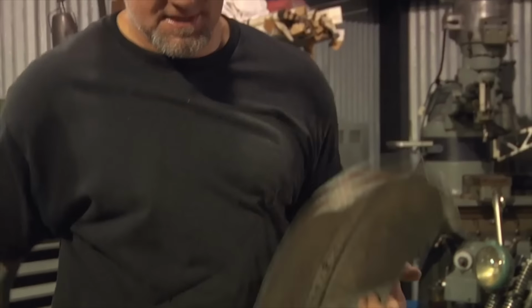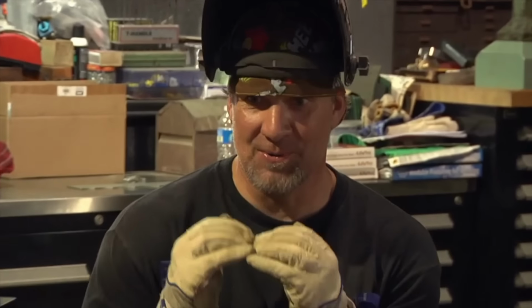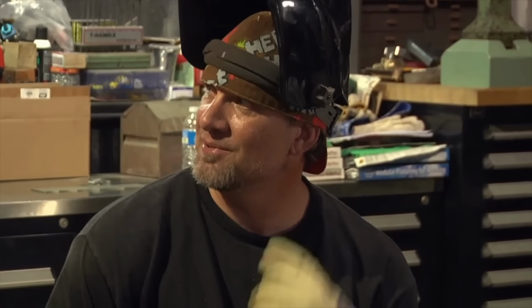You always sand those tacks down. Never weld over the tacks unless it's a super flat one, because then it'll camel hump, because metal will add more metal where there already is some. And one good thing about that bead is it holds the piece in place. It won't warp it up. It'll stretch it and move a little bit, but it pretty much locks that weld right there. So you could just sand it, kiss it to finish it.